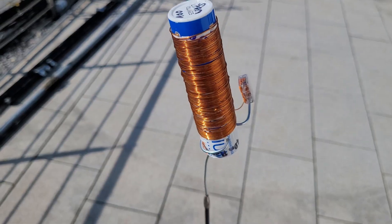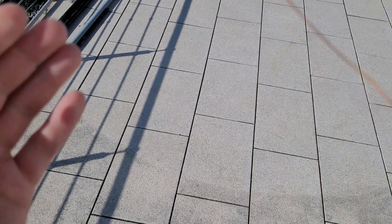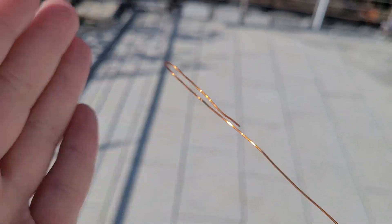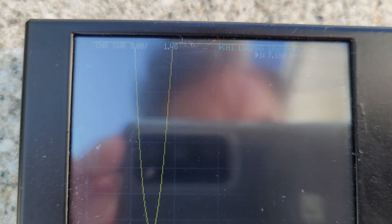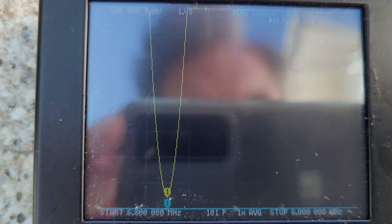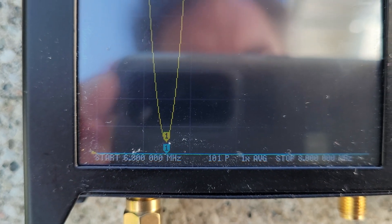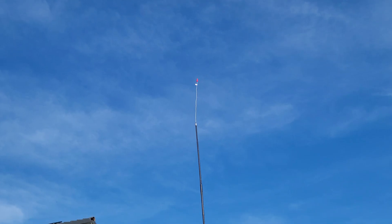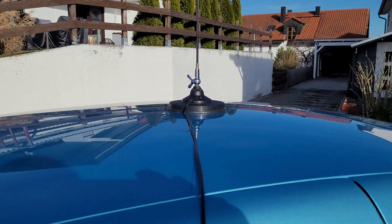But do not expect wonders. The antenna must be very inefficient. It's narrow on 40 meters so that you have to use a tuner for the ends of the band. But I love to build such things out of waste and a little bit of wire. I have tested the antenna — just one minute after my video, the first contact went straight to the United States. So that's great, isn't it?